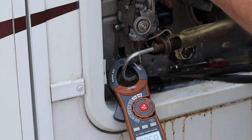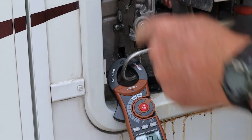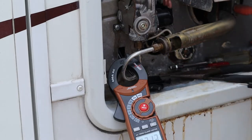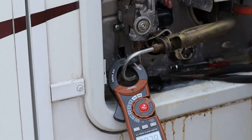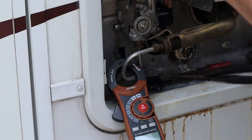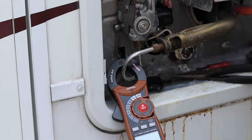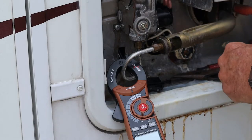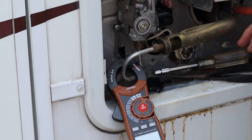Now we've got power. Both of these thermostats had tripped out — that's pretty unusual, we don't see that happen very often. I wonder if they're getting wet because of this drippy pop-off valve. We'll take that cover off and look in there real quick too. This is the cover for the thermostats up here; they do have a reset button on them. I don't typically check that first because we just don't see those trip out very often. One of them is for the AC side and one of them is for the gas side.